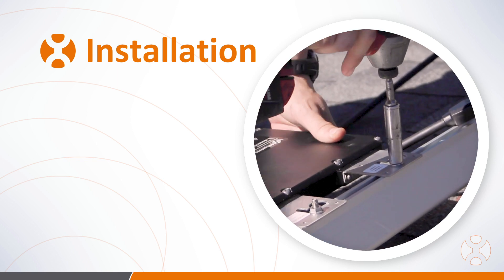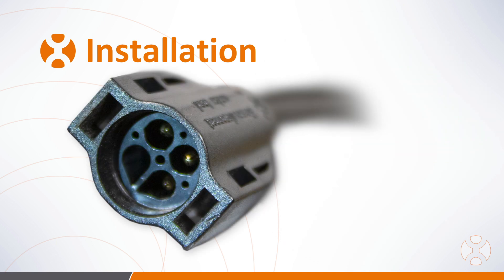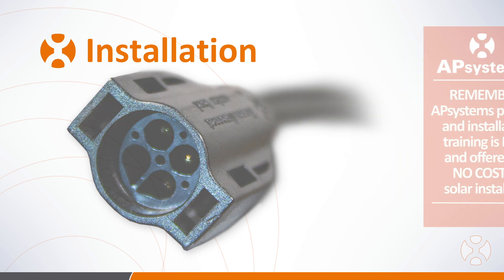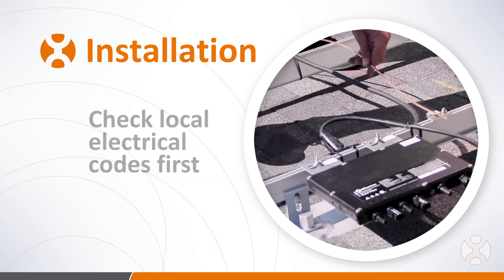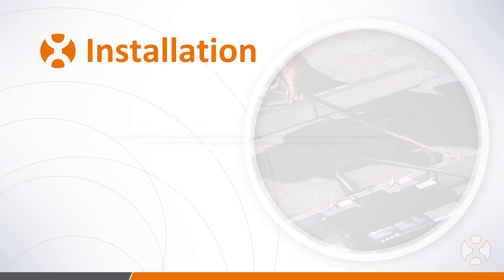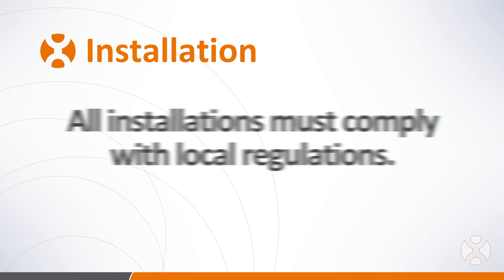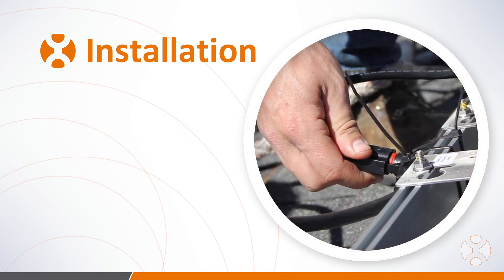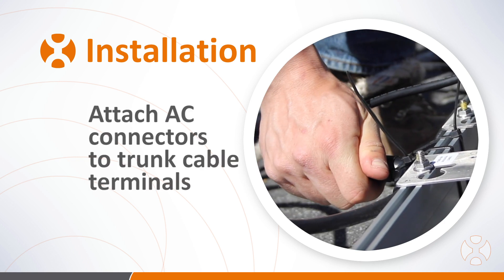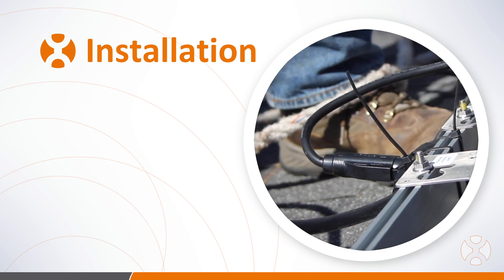Confirm the spacing for proper airflow. Both QS1 and YC600 microinverters have a built-in ground wire within the cable; however, be sure to check if external grounding is required for installations in your region. Remember your installation must comply with all local regulations and compliance standards. Place the microinverter AC cable connectors into their respective trunk cable terminals and listen for the audible click, which tells you a sealed connection has been made.